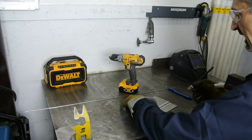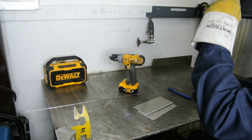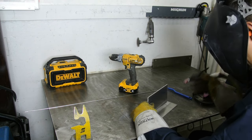I'm running at 160 amps, which might be a little bit low or maybe a bit high. This is one-eighth aluminum, 5000 series. Let's tack the corners and see what we get.